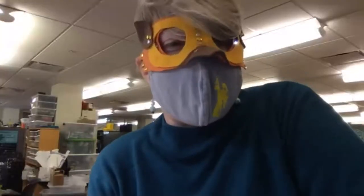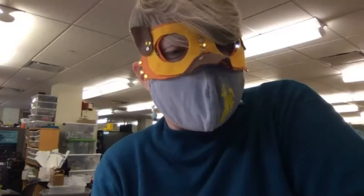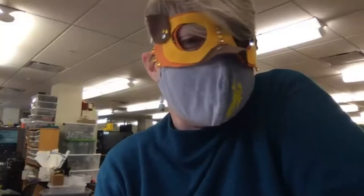You've got to troubleshoot the circuit, and sometimes there's a loose string that'll connect and hit the other lead. That could cause it to not work. Sometimes you might have an LED flipped, so make sure all the pluses are on the same side and all the minuses are on the same side for all the components. Yep. Okay. How about yours, Cricket?